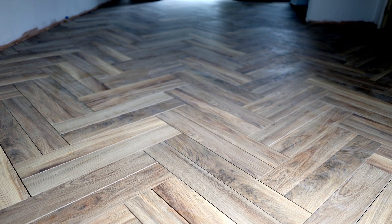Before we talk about system performance, we need to talk about this floor. The ground floor is now tiled, and I had to turn the underfloor heating off to allow the adhesive to cure. If you check Open Energy Monitor, you'll notice that from the 31st of January the system has poorer performance and more cycling. I'm keeping the system off until around the 10th of February. In that zoned period, with an average external temperature of 10 degrees, the average COP was 4.7. Looking back at a comparable period when the underfloor heating was fully on, the full system performance was around 20% better with a COP of around 5.9.